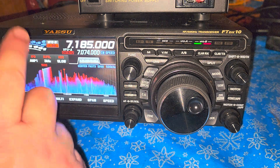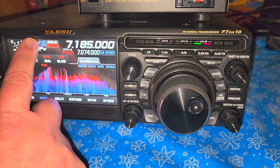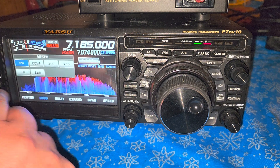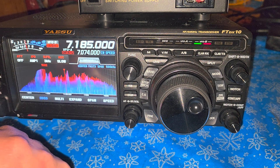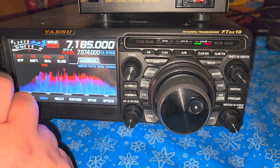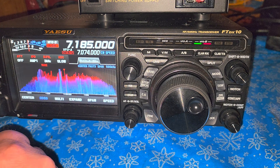It's really cool because in the touchscreen you just touch the meter and then you have all of these functionalities that give you all of that. So you can switch to SWR and when you transmit you'll see your SWR, and of course you can tune the receiver to change that into something that maybe the auto tuner can actually adjust better.